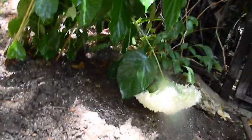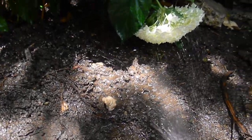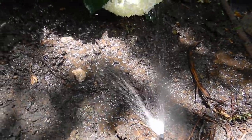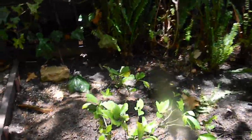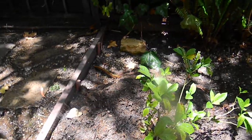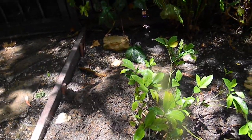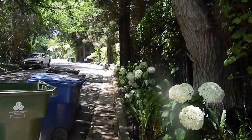The difference is, even on this little slope, the droplets get larger. The larger the droplet, the more the wash-off, runoff, and erosion occurs. This is all water that would be available on a charged pipe the next time the cycle is going off, and is draining from the downhill action.